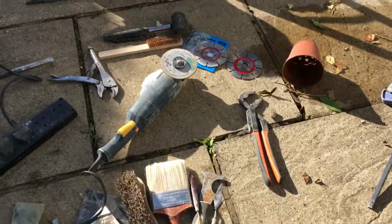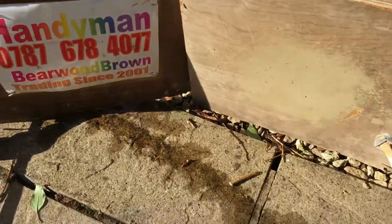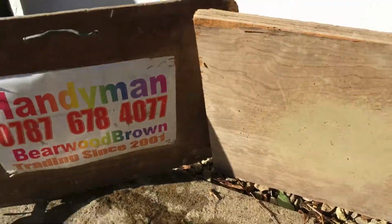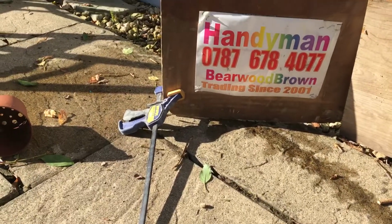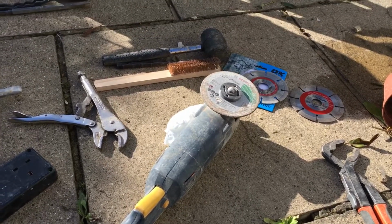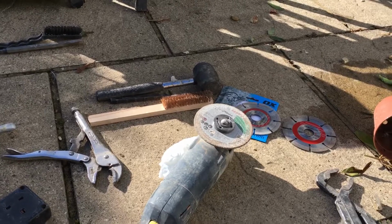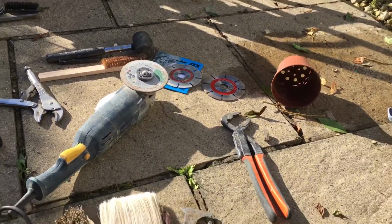So anyway, we're going to use that grinder. We get the vacuum set up over here, so it's sucking. I'm going to have the vacuum lined up on this line, and I'll shoot into those two pieces of wood with the clamps on them, which are working brilliant, blocking it down. And also, I'm not going at a real high speed. This is adjustable speed. If you have one of those that goes 10,000 RPMs, as soon as you turn it on, you can't adjust the amount of dust you're putting out. So dust is a big issue. You end up spending a lot of time cleaning it up.